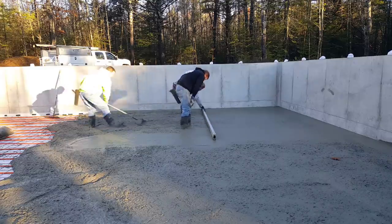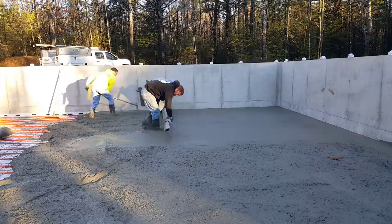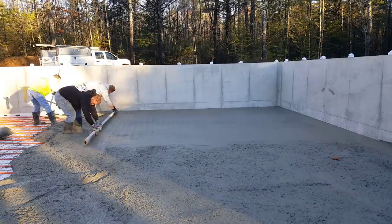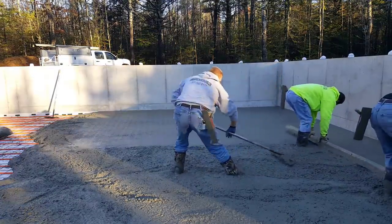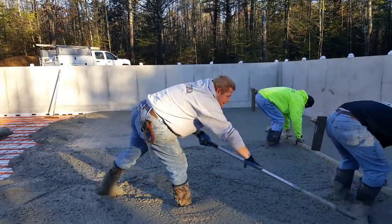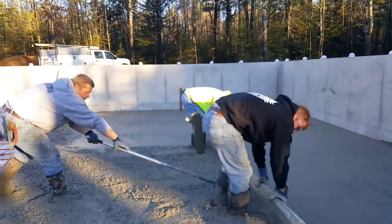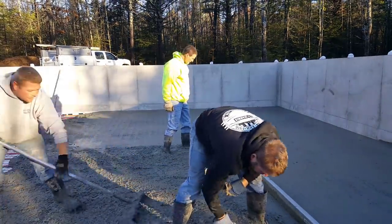This is just the way we were taught years ago, so this is how we do it. I know some of you guys do it a little different, and that's fine — the whole point is just to get it done, get it flat, and make sure it's right. As soon as concrete starts building up on those pads, you can see those guys stop and clean them off. I got it a little high in there — you can see I'm raking quite a bit out. That's about as easy as it is screeding out a bay like that with a 14-foot screed. I'll have links to the tools we're using — the screeds, rakes, mag floats, and margin trowels — down in the description if you want some.